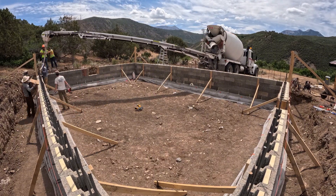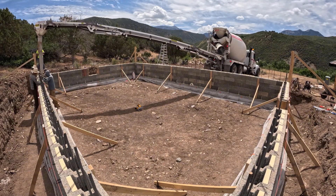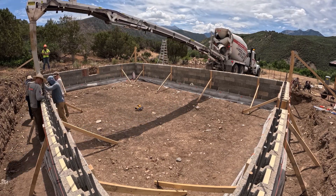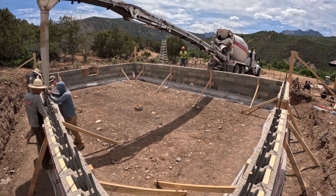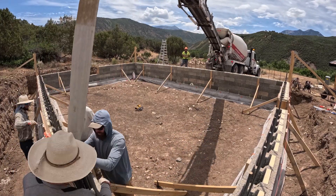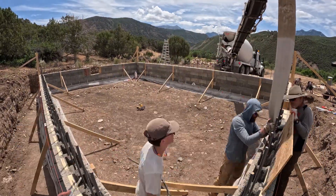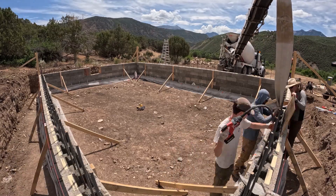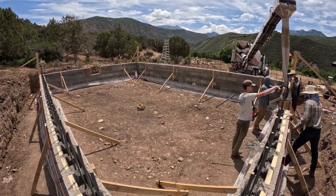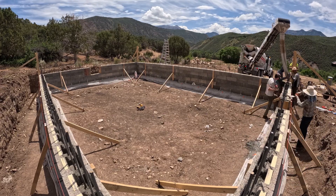With the conveyor, there's a little sock where the concrete runs up and drops. One of the guys was on a board and I was controlling the sock. We realized the best way was to have the concrete hit the backboard and then slide into the blocks. Inside the blocks, the concrete needed to go to the bottom and fill out. We used a 7-inch slump of a special wall mix with a maximum 3/8-inch size gravel. It did a great job going down to the bottom and spreading out. We lightly vibrated each cell, and the whole pour ended up only taking about 30 minutes.